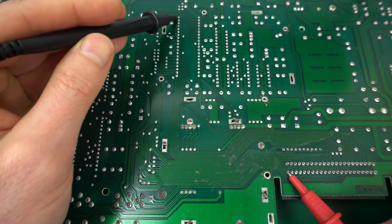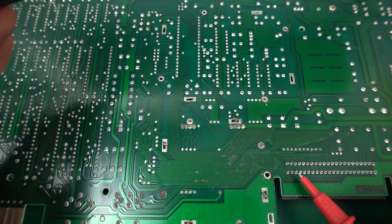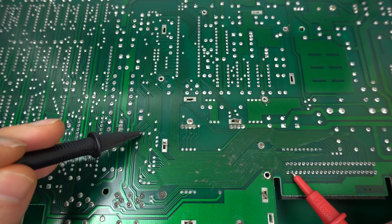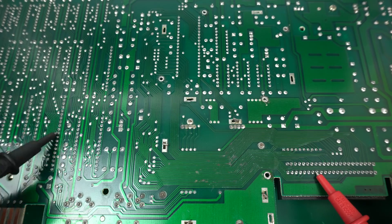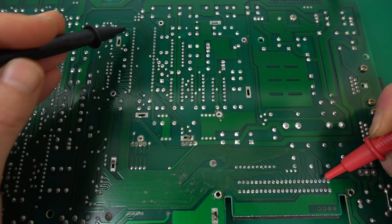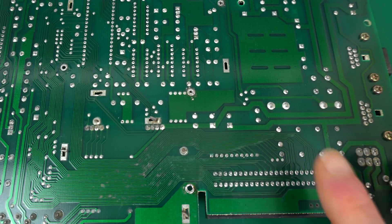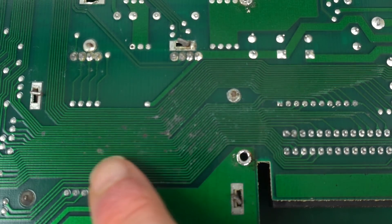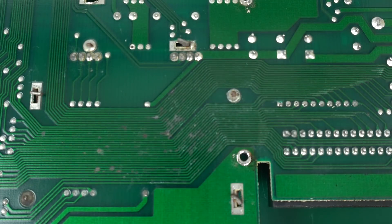So I'll just do it quickly. I don't even know what it is, but that one is connected right there to the VIC-2 chip. So I'll just continue doing that with all of them. Surprisingly, they're all connected correctly to other parts of the board. That's really good. So I don't want to make this any worse, but maybe what I'll do is I'll apply some lacquer to just prevent oxygen from getting there and the corrosion getting any worse and eventually getting into the tracks.